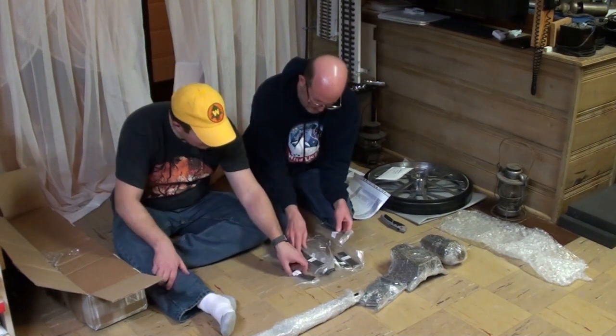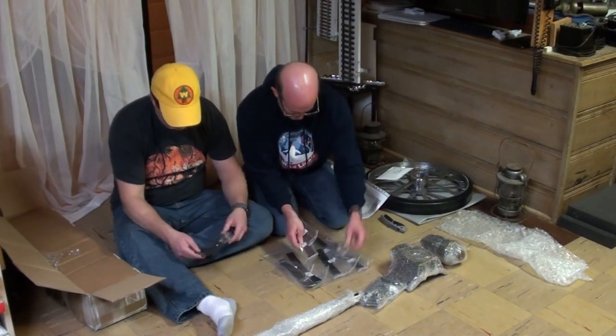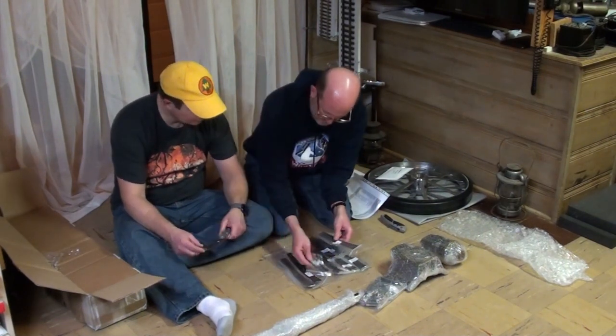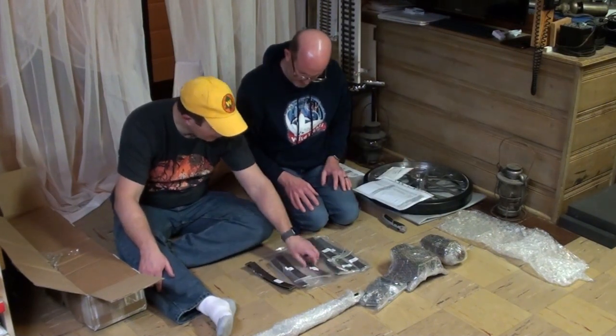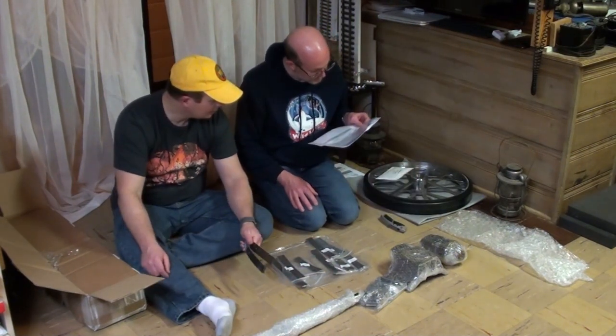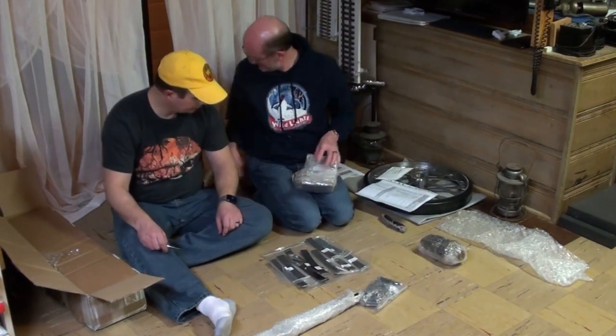When complete, the engine will be 33 inches wide, 83 inches long, and 48 inches high with a weight of 1,650 pounds. The boiler is 10.5 inch diameter, built of welded steel boilerplate, and designed and tested for an operating pressure of 180 psi.